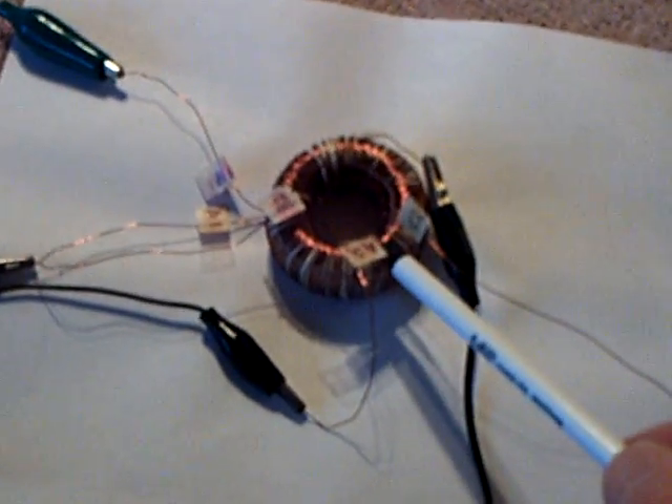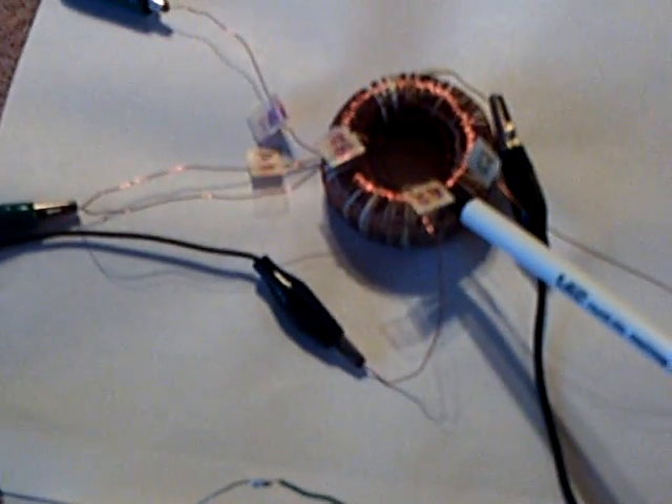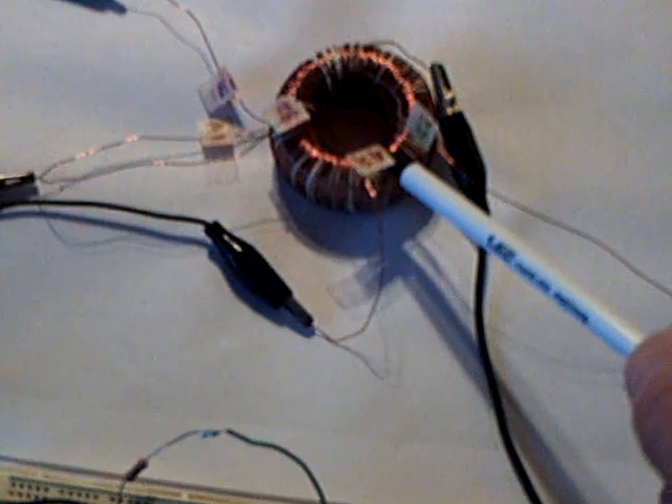This Slayer circuit is a winner — it works quite well. This toroid is critical. You can't use washers, you can't fudge on that. You've got to make it out of a ferrite core; you can get them on eBay for about $5. It takes probably two hours to wind: that's 20 wraps on the primary and trigger, and 440 wraps in three layers on the secondary.